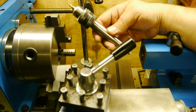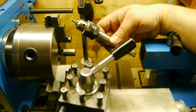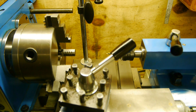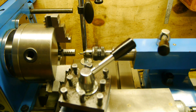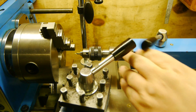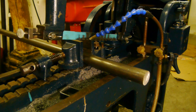Some time ago I made this arbor for this small drill chuck and I've been using it for center drilling. But recently I ran into a problem where I just couldn't reach the workpiece because of the length of the tailstock quill. This is as close as I can get, so I'm now going to make a dedicated holder for a center drill that is about five or six centimeters longer than this setup. I bought some four centimeter thick mystery metal, hopefully it will be machinable.